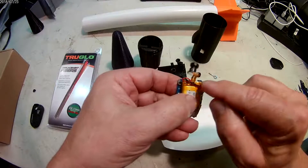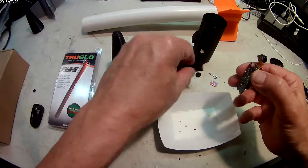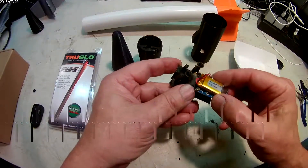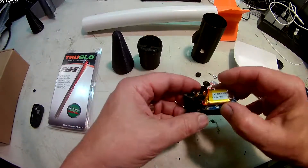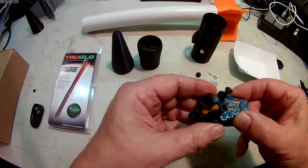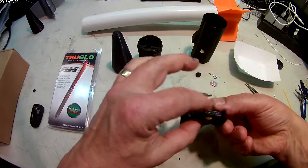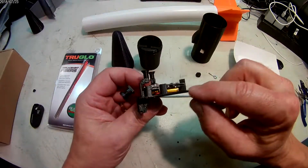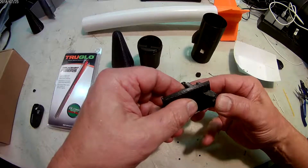So now the battery — the top of the battery is pretty much aligned with the PC board. Take your camera tray and slide this whole mechanism together like so. It just tucks in underneath the two funnels and it should fit now flush. You'll see the battery has now cleared this back pedestal. Bring the camera around and it will just snap in place.